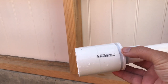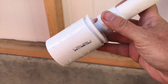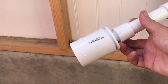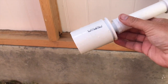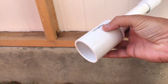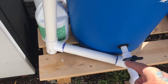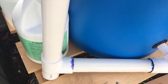On the other end, same thing - a barbed male three-quarter to slip three-quarter. You probably don't need that extra part if your sizes are correct. I bought one of these plugs thinking it was a two-inch drain line but it's actually inch and a half. Luckily I had an inch-and-a-half plug to half-inch thread, then a half-inch thread to three-quarter slip, so I didn't have to make another trip to Home Depot. Next time I might get one in three-quarter so it doesn't bog down.